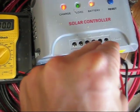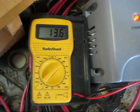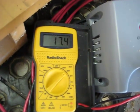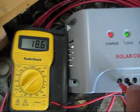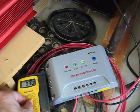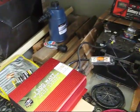Over here on the battery you can see we're reading 13.6 volts — that's what it's putting out to the battery so it doesn't overcharge it. Now we're at 15, 16, 19 volts — you can see the clouds moved away and now the charge controller is flashing, which means it's regulating the voltage so it doesn't overcharge the battery. I'll go into more detail on all this. Very excited on how this has turned out. Appreciate all the help from Al online, and I'll keep you updated on all the different components. Thanks a lot. LDS Prepper out.